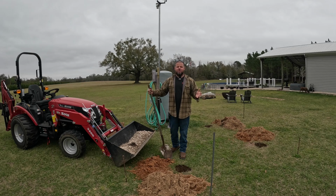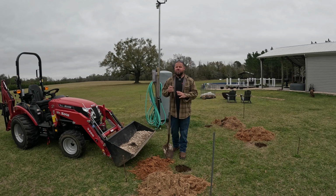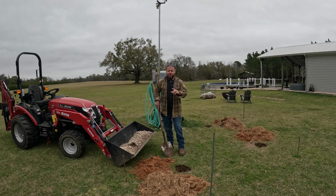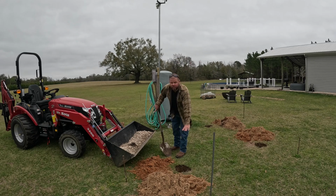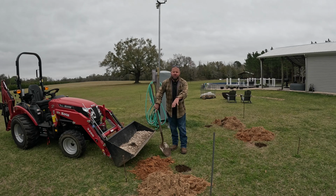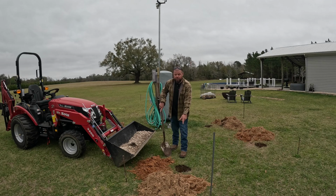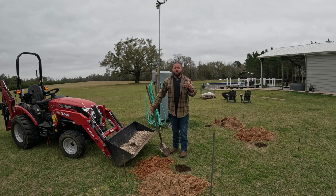Yes, there's concerns about rot and other things, but a properly drained post I found lasts a very, very long time. And I'm doing this a very special way for a lot of extra strength. I love to overbuild things. Instead of setting my posts in the ground and cutting them off and then coming back with my ledger boards or baseboards, screwing to the outside and then framing up traditional walls, I'm gonna go ahead and run the post all the way up the corner of all the walls, getting that strength carried all the way to the roof in this. So it's very, very strong.